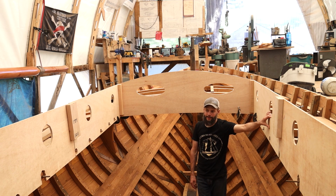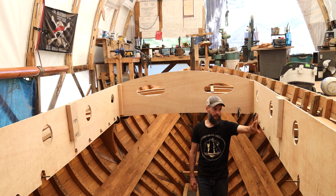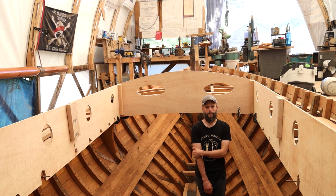And it would be nice not to be hitting the ring shank nails when we cut them out. Mm-hmm. But by the same token, we'll do it with the Festool jigsaw, and we can just put a bimetal blade in there, and it'll be a little slower cutting the wood. But if we hit a bronze nail, it'll just zip right through it. It won't matter. So even if we do decide to move them a little bit, it's just a couple, which we might have to anyways. What do you mean? Well, when you figure out where the bulkheads are going exactly and if it fits exactly in the head where you want it to or not. That's true. That's very true.